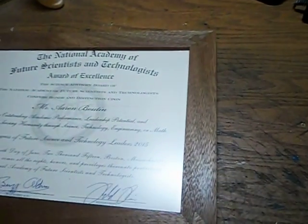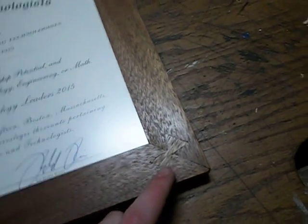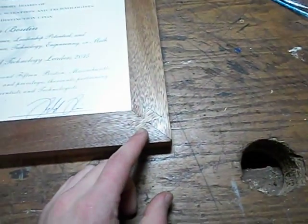Some interesting points: make your own wood putty — find sawdust and glue, it's about a one-to-one mixture. Now this joint — some people would try to use a router. If it was a joint this big then I might use a router, but in a joint this size you need a very small router bit and you need to be very, very precise. So I wouldn't use a router bit; instead I use a chisel. You have to make a template for that. I keep my templates over here.